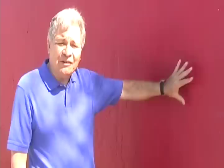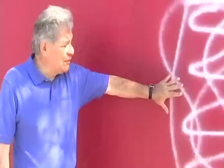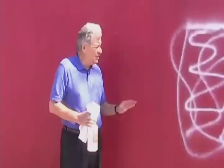When you have a wall painted in acrylic, our spray bottle will remove that. We call it a window of time — our product can remove the red and the graffiti, but in this case you just want to remove the graffiti. When you remove the graffiti, you have a window of time before the formula works on the underlying surface. We normally neutralize the formula with water, and that's all it takes.